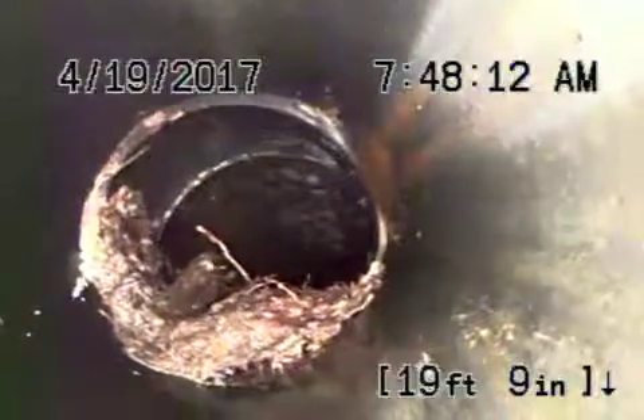Let's come back slowly — there's going to be another coupling coming back. Right about there, and that's like three feet deep over here as well. You can see the pipe is obviously broken into because there's no coupling here or anything, and there's roots coming in. Obviously the pipe is broken over there. I've located those two spots for you.